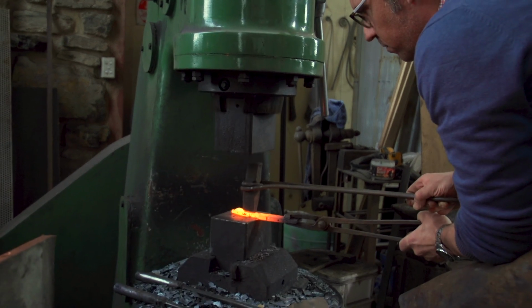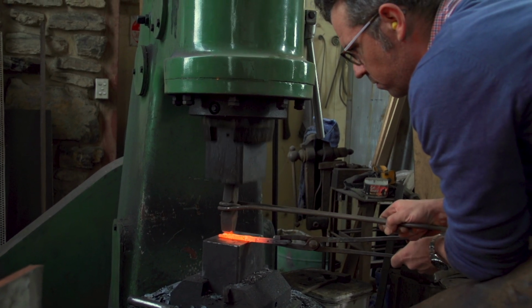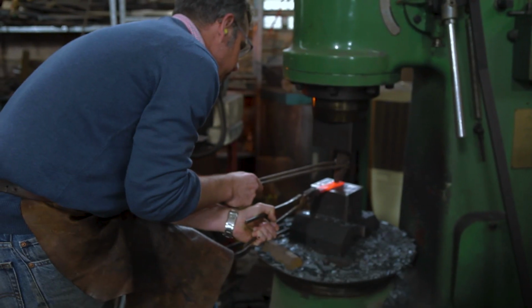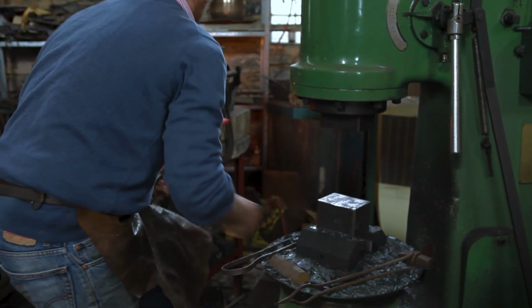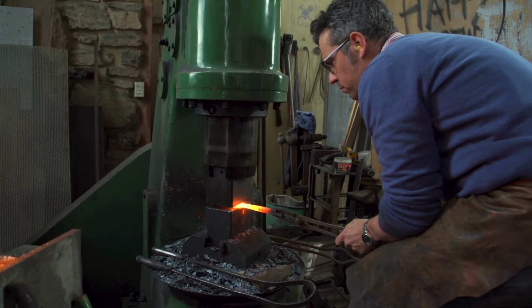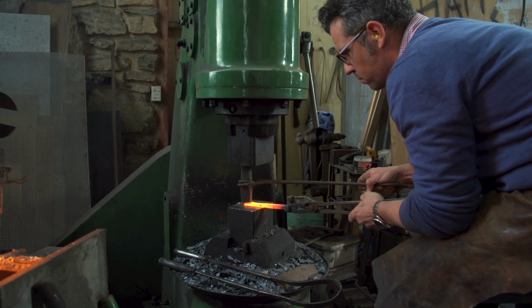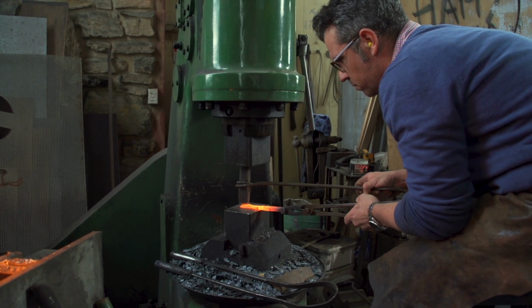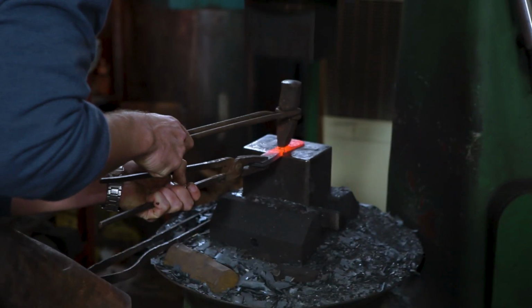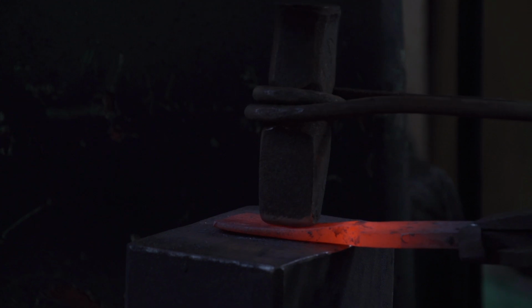And then probably using the same fuller, fuller out one side of the material to make a big feathered triangle, basically. Pinch out the material, and with a fuller, the material spreads on either long side. So you can control how you spread the material with the actions of the fuller.